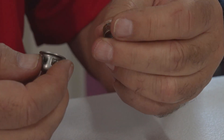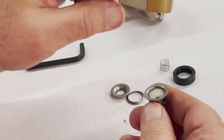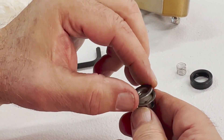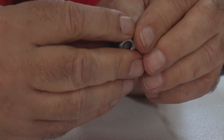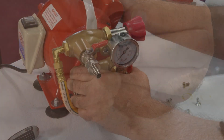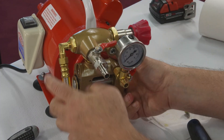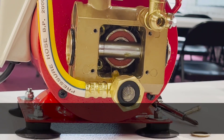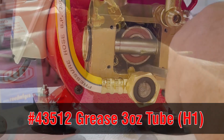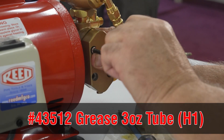Replace the check valve seals and springs. Push the metal cup out of the rubber seal and replace the spring. Push the assembly into the new seal and return the valves to the housing. Mount the pump back onto the motor or bearing housing and refill the pump housing with a water-resistant all-purpose lithium grease if needed. Then reassemble the end caps.